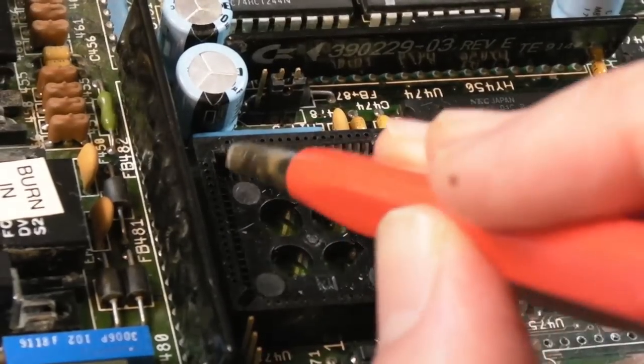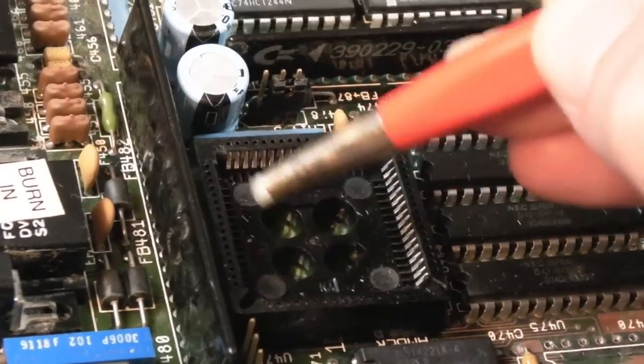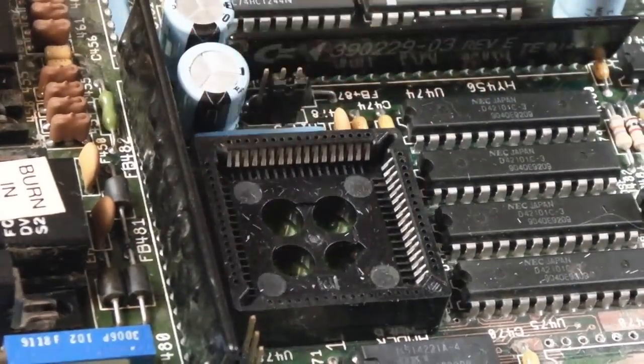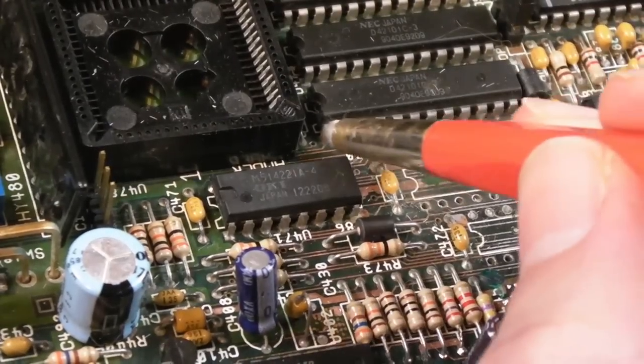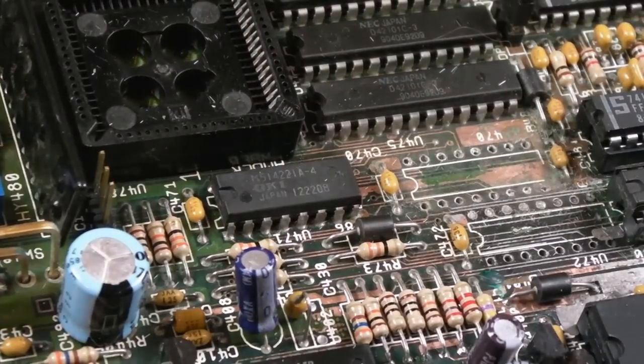And it is alkaline, it's not battery acid, it's alkaline. Use acid to treat it, and then wash away with IPA. So I'll have a good scrub around there now, I think, with the vinegar, and see what state it's in.